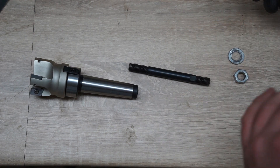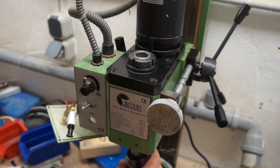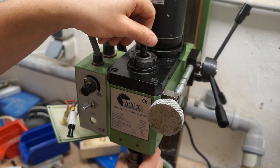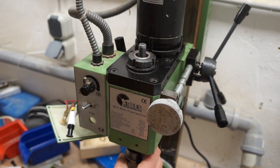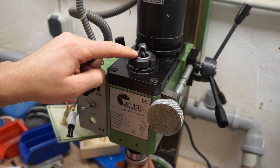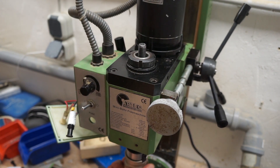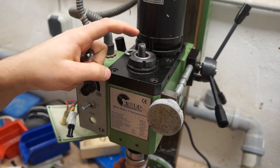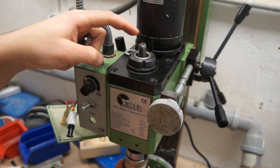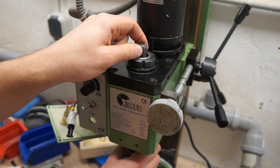The second problem I'm going to show you on the milling machine itself. This is the spindle — the tool goes in from the bottom, then the threaded rod from the top, and you can already see that it turns around quite a bit. On top, a washer and a nut draw everything together. The problem is that this has a lot of play in here, so I would like to make a bushing that sits inside this bore and has a hole in the middle to accept the threaded rod.